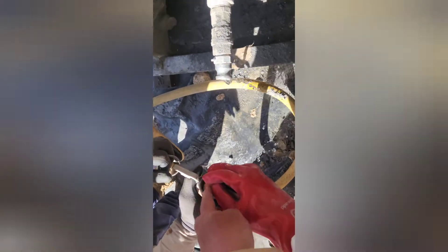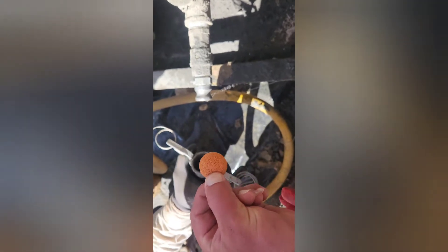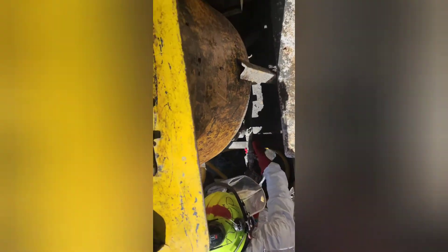This is called a pig or a line sweeper. Make sure the line's wet. Put this inside of the hose — it's a tight fit, you've got to pop it in with your finger. Connect it back up. This is something that's good to do every day, every time you clean out your lower hopper. We're going to pump it out and pop this ball out.